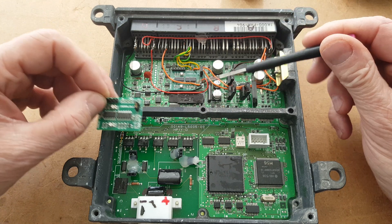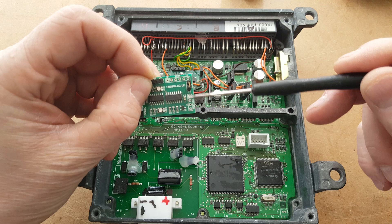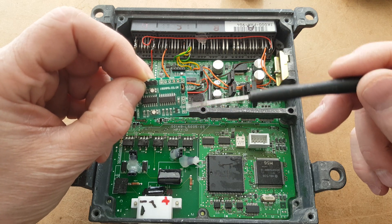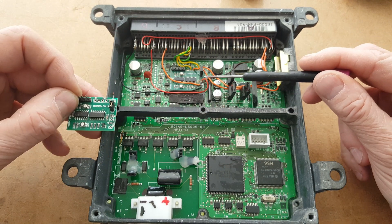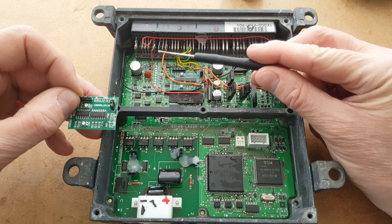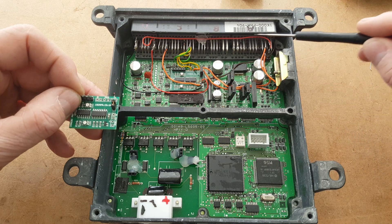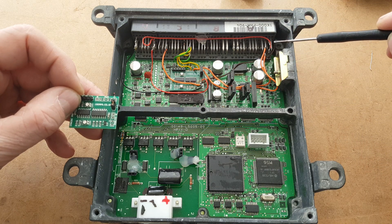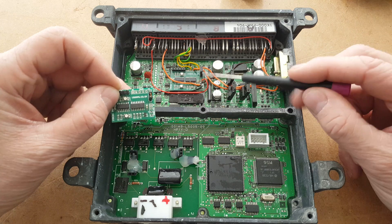We'll start with the power. Pin 1 and pin 4 on this little strip — pin 1 is plus 5 volts and the bottom one is ground or negative. You can see we've got a red and a black wire here and they just go over to the corresponding pins, red and black. Ignore the red wire going along the top to that other pin — that's for a separate modification. So that covers the power and ground, and then we have the signal wire.